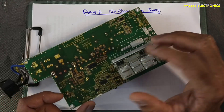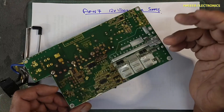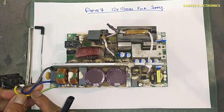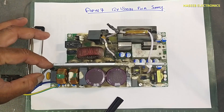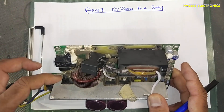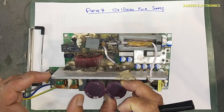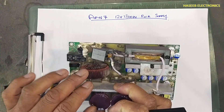How the circuit is configured and all possible faults, their troubleshooting and solution. Input line, ground line, neutral — three wires. This wire is the ground or earthing wire. Line and neutral enter here — fuse first, then EMI filter second stage. The power supply then reaches the bridge rectifier, then to the DC rail. Between the DC rail and this section there is also a PFC section, which is a voltage booster.